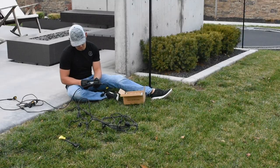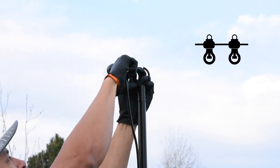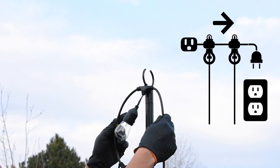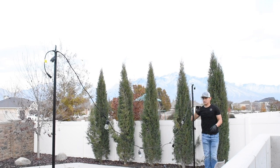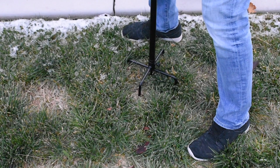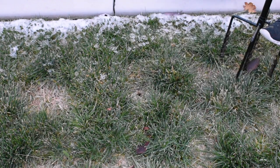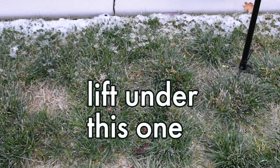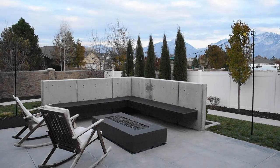Now I have all my poles in place — time to grab the string lights. A lot of patio string lights have little holes right above the socket for hanging, and you can take the ring on top and put it through that hole. Consider your power source and the end of your string light pattern; I started with the female end and worked backwards to my power source. When I tried to attach one pole to the other, the tension didn't line up with the socket. A quick fix was to move the pole — just get a firm grip and pull straight up. If installing in grass, this isn't bad for your yard; it's like aerating it and the holes are minor. I tightened up the tension and reinstalled it. If you need leverage to remove a pole, make sure it's underneath the bottom fork, because the top fork could slip and scratch the powder coating. Once I had appropriate tension between all poles, I connected the power source and plugged it in — done.